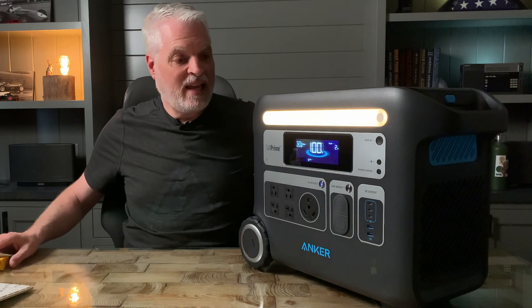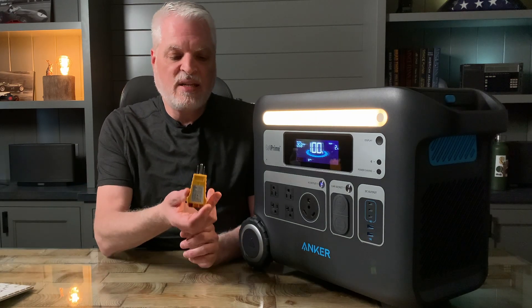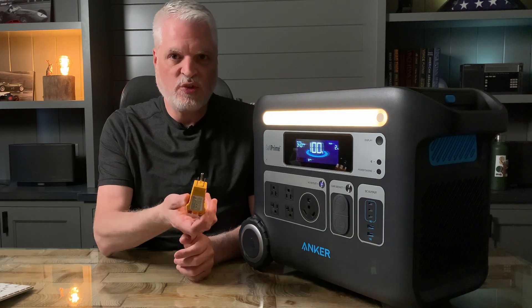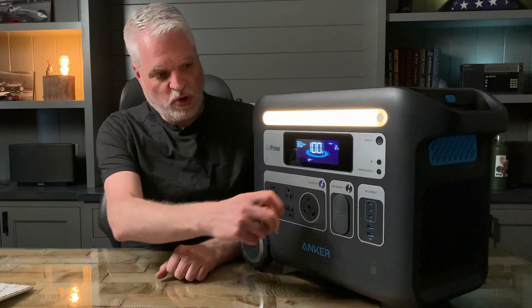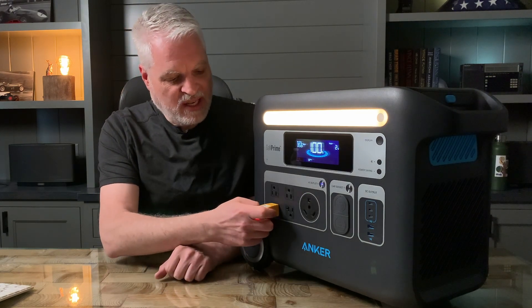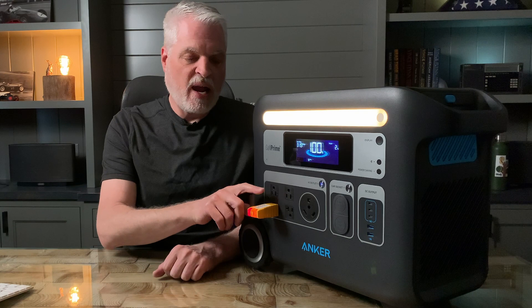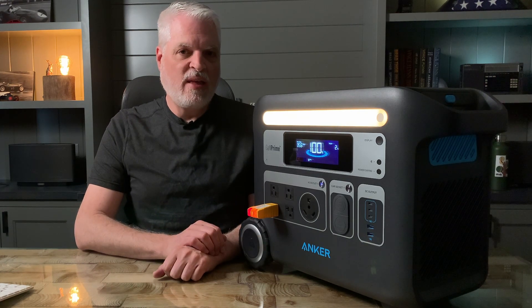My unit is affected and I'll show you what that looks like. This is an AC power tester, or outlet tester. You just plug this into an AC outlet and it will tell you if it's wired correctly. You turn on the power on your inverter and then plug this into the outlet. You can see here that I have a yellow and a red light lit up — on my particular tester, that means it does have a reverse polarity condition and that the neutral and the hot wire have been reversed.